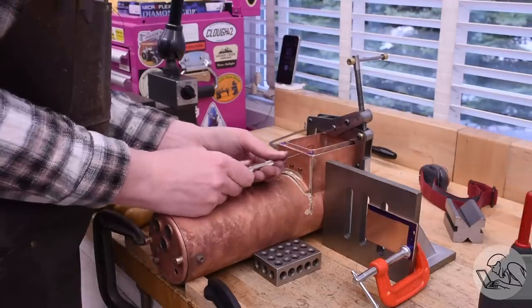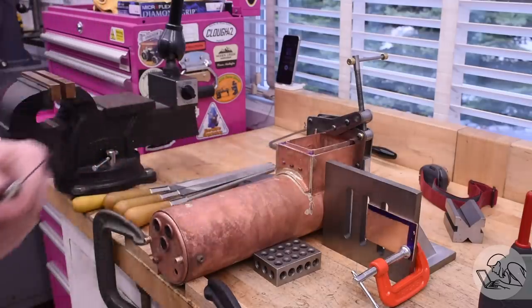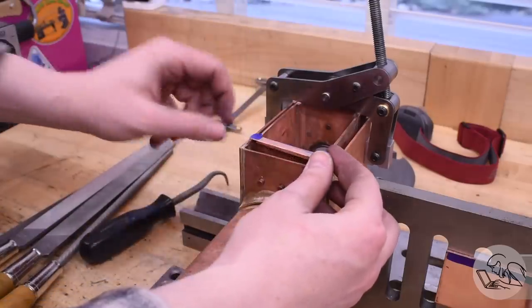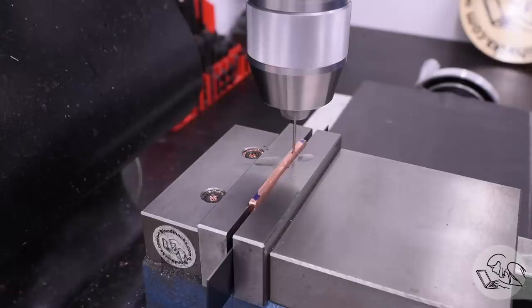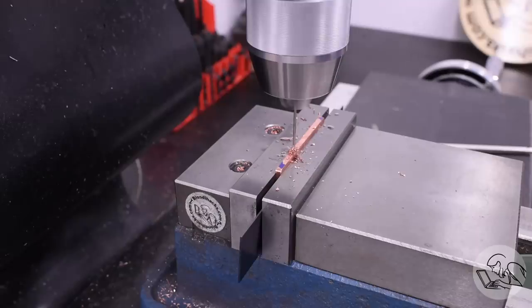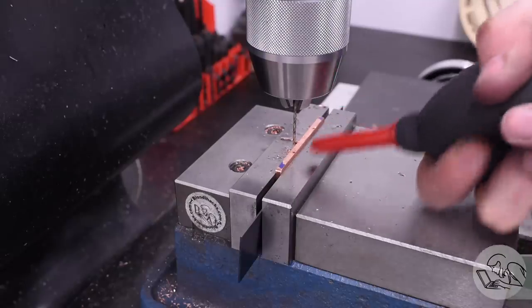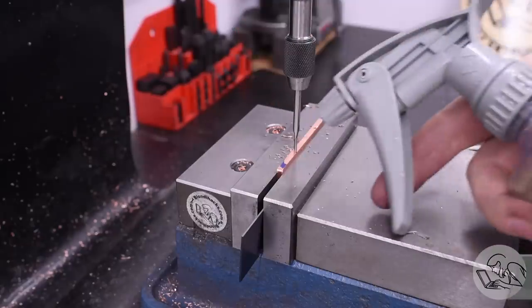I went through the sheet metal just into the bar to make a dimple on each position, and then I'm going to do the drilling and tapping on the bar over in the mill. Unfortunately my hand measuring was not great and I ended up very close to the edge of the bar, but I decided I could just get away with this. I didn't want to shift those holes up further into the center of the bar because then the bar isn't going to be flush when it's installed. So I took my chances, and I think I just got away with it — these threaded holes are right on the edge of the bar, but this only has to survive long enough for silver soldering, so I think it's okay.